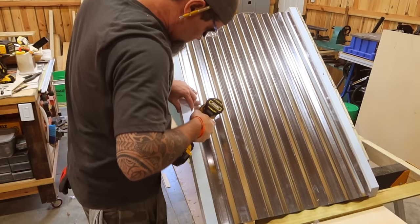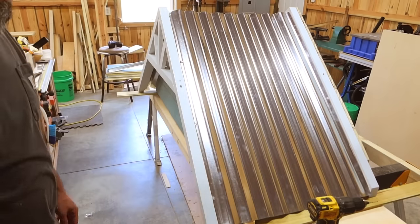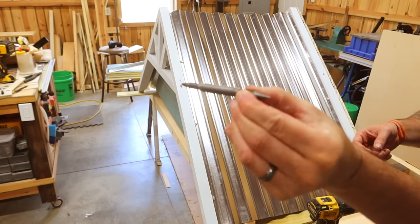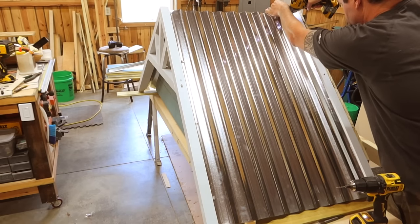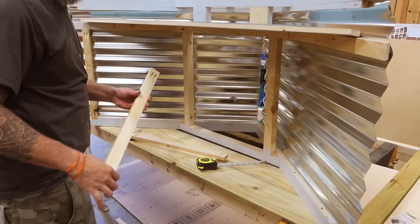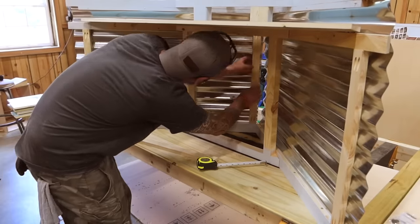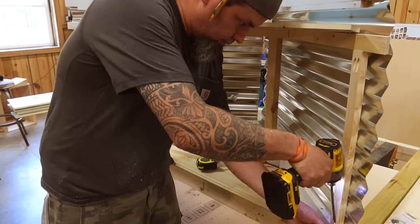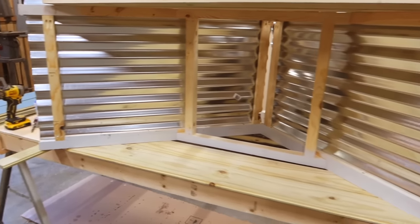I will be pre-drilling all of these screws. What actually helps to keep the bit from walking on metal is a super handy little pop tool — one side is a spring-loaded nail punch and the other side is a spring-loaded drill bit starter. I'll throw a link in the description. At this point if you'd like to silicone the sides, go for it. I should have added extra three quarter inch material when building the frame of these trusses, but I'm throwing it in now to help support the roof. Hindsight is 20-20, but it wasn't too late to fix it. Much more sturdy.